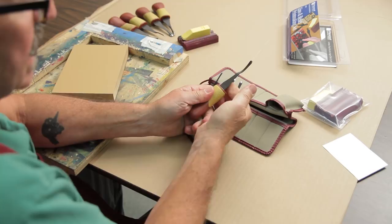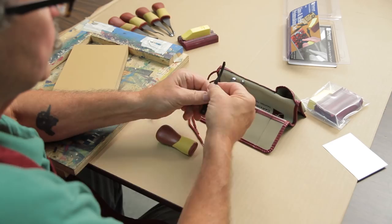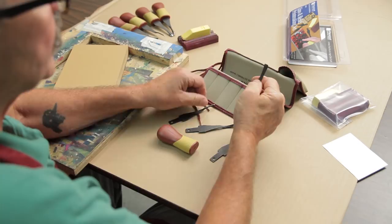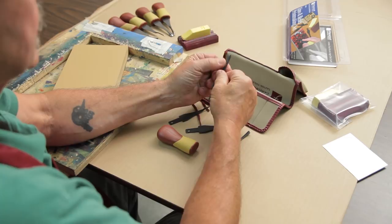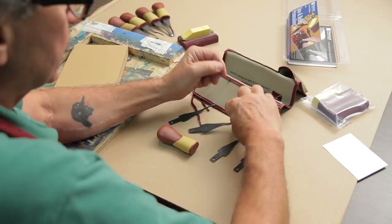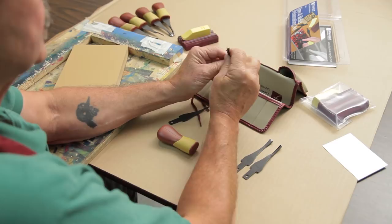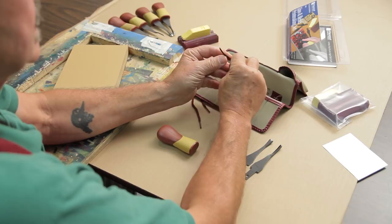When I take them out, I'll hold on to them and leverage them out because they stay nice and tight. The tools we have here — there's a very flattened U gouge that is often referred to as a sweep, and that's really good for taking out large areas and creating textures. Then there is a nice U gouge that goes very deep, good for lining and exceptionally good for texture. This V gouge or V tool is the workhorse of my set. And then there's a very nice smaller V gouge for detailing.